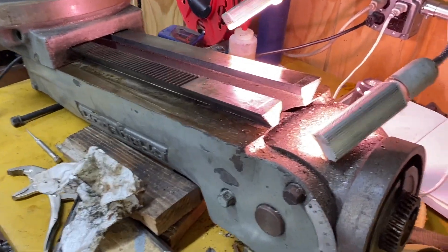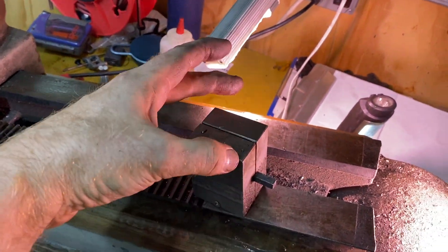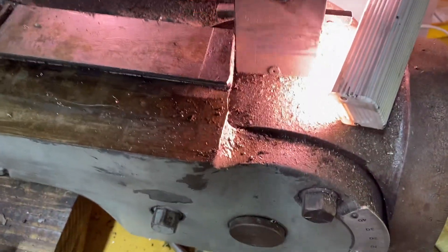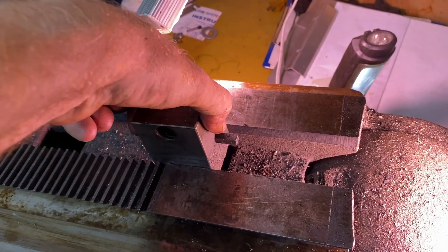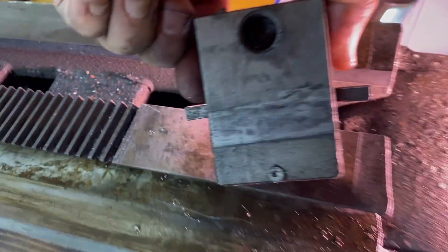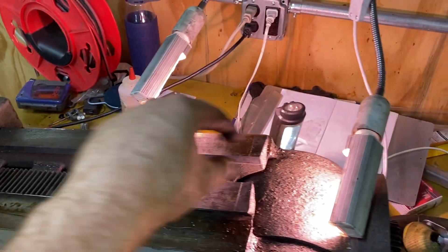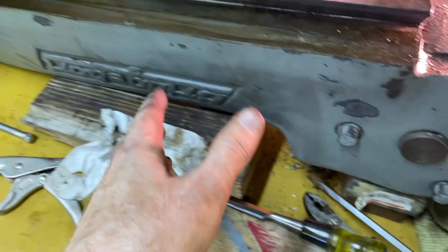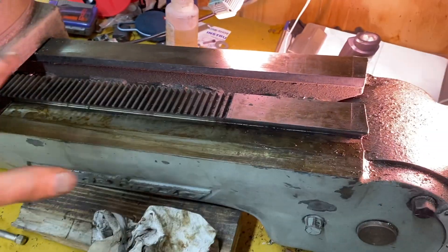I've got these blocks off — these are the locks. When you screw it in, it spreads apart and grips against the side. These normally fit in here like this, and then they have those pegs to keep it from falling down in the hole. I thought we could just pull it straight out, but there's a high spot right there that looks almost like they manufactured it that way so they wouldn't fall out. So you have to go all the way and then slide it out one way and then the other. And I did figure out my terminology — this is the ram, this is the turret. I'm going to slide that turret completely off and then clean it because it's very sticky.